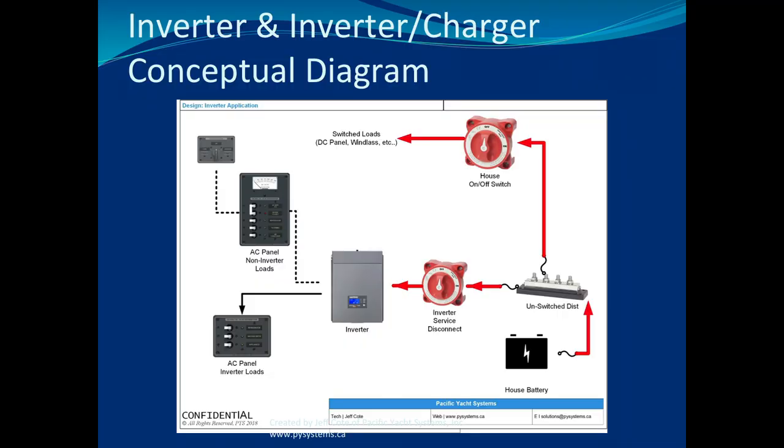So if you lost shore power when you were at the dock, let's say, and then you also lost your inverter, it's because you asked the inverter to do something it couldn't do, and the fuse, which is called a class T fuse right here, blew. And that's why everyone should always carry a spare class T fuse if they have an inverter charger. Always. Class T, class tango, like classroom, class T fuse. Find the fuse for your inverter charger, whatever it is, and buy another one.